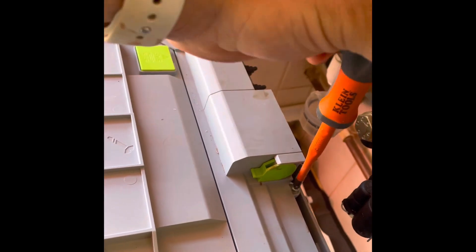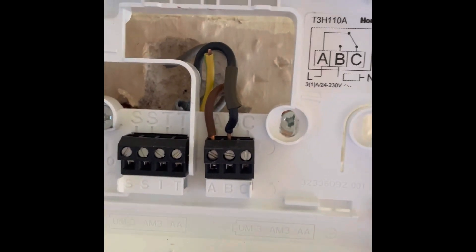There's a hidden screw there and then two finger tabs — just undo those to get to the wiring. So you've got live, neutral, earth coming in, and then you've got grey going out to the programmer and then black coming back for your heating to wire it — that's how it is here.